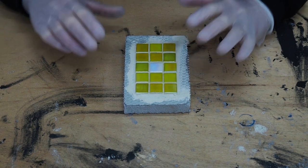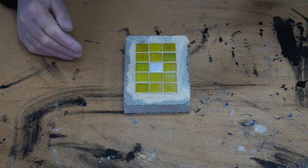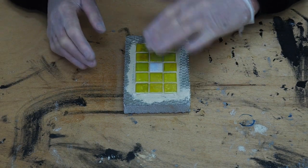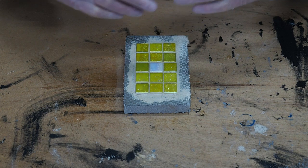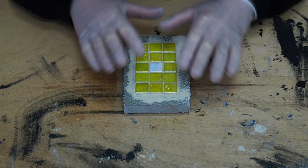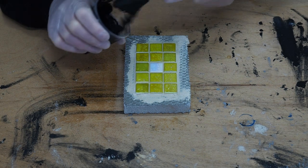Now I'm not saying this is the only way to re-grout but this is just the way I do it. I have a bottle and I just give the surface a light spray just to dampen that bit of grout that's there. That will help so that the grout there won't suck the moisture out of the new grout, and it just makes it a bit easier to adhere. So I've got my grout here and I'm going to grout this in black.